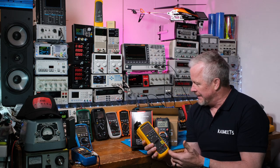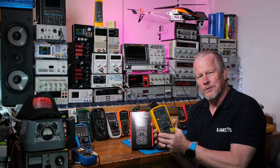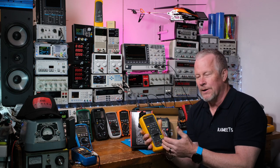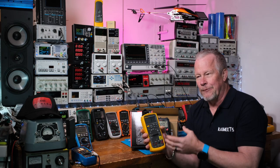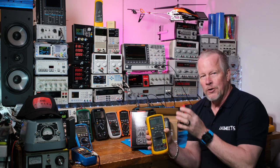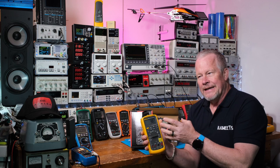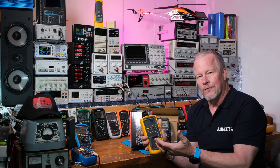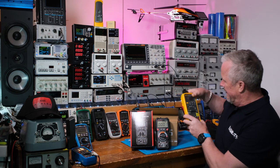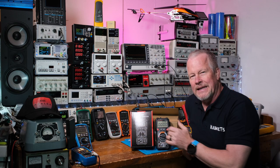Well, that's because this thing was designed like 22 years ago. It was the first one made. It's kind of older technology, it's slower. Some people are impatient - they want their readings right away. So they said let's go 6,000 because we can do the math and show the digits real quick to auto-range, and to show those extra digits for 20,000 count takes some more time. So I think I will use that meter to compare to this new 20,000 count.